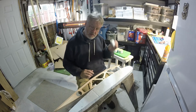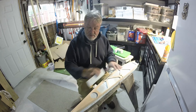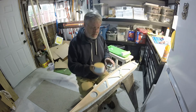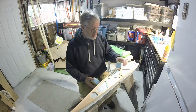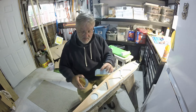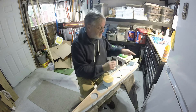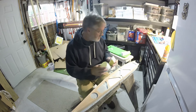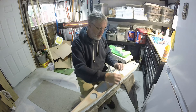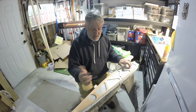I used a cardboard template I made to create this sanding block, which gets me all the way back from the tail of the ribs — and it does. Then it takes two more sanding blocks. I thought the bigger one would carry me through most of the rest, but the truss holes make it so it only works for bridging the gap between where the little corner one leaves off and up to around here. The big round one gets me through most of the center section. Between the rubber taco for the outsides and edges of the cap strips and these three improvised sanding blocks, I'm now making good progress getting these done.